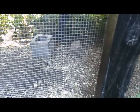The other thing is we've got a hole here in the fence that, I don't know if you could see, I have to fix. Well, this is actually hardware cloth. It is not chicken coop wire. To be honest, chicken wire is not going to stand up, or at least in my opinion is not going to stand up to a bunch of chickens or anything that's trying to get into the chicken coop. That actually happened because I had something leaning against that and it broke the wire. But what I'm going to do is take some hardware wire and cut out a piece and then thread it around with some wire to make a patch.